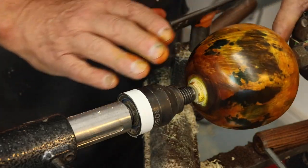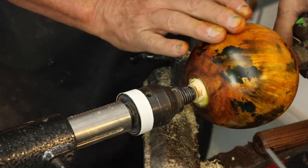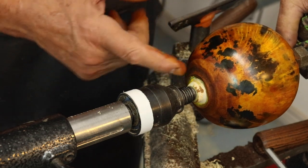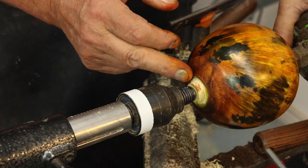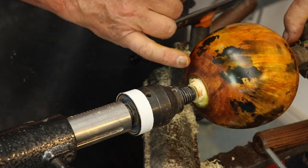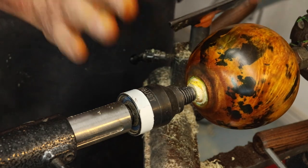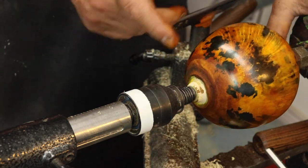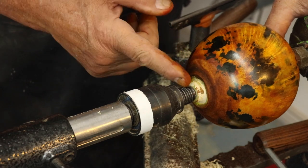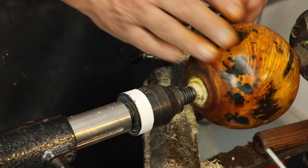Take a look at this now — I had to come up the side of my vessel to blend this in, and I also have to take some stain right here and blend that color in. I'm almost there. I've got to apply some lacquer and let my dye dry. I was a little bit nervous — whenever you take that surface back to bare wood you have an issue blending it in, but I think it's going to be okay. I'm pretty happy with that. I'm going to keep whittling this away and this vessel will be completed.